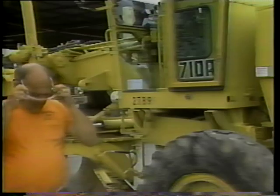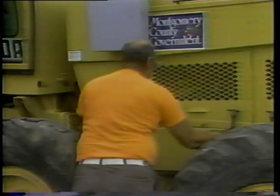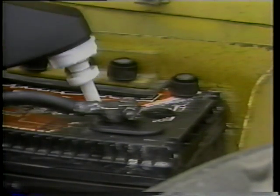Important additional inspections are at the battery. A word of caution: all batteries give off explosive gas. There should be no open flame or smoking permitted around the battery. Follow your local safety guidelines when working with batteries. If needed, fill each cell to just above the top of the battery plates and separators with clean distilled water. Never fill the cell to the top or allow the fluid to drop below the top of the battery plates and separators. Before you leave, make sure the battery is securely fastened, and check the battery cables, clamps, and connections for tautness and corrosion.